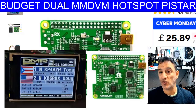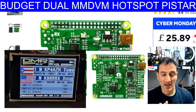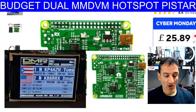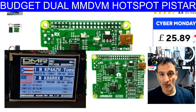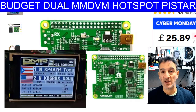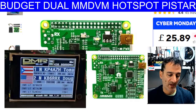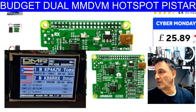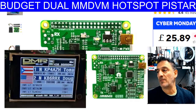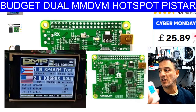From a learning point of view it's excellent. If you haven't got a hotspot and you're using DMR, D-Star, or Fusion, you are missing out massively - because it is literally like having a repeater on your table. There's still radio, there's still RF, because the RF goes from the board to any digital radio in your house. It's not AllStar - that's a different technology we'll cover separately.